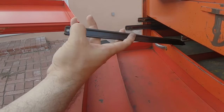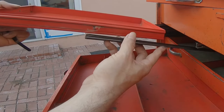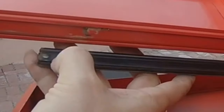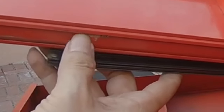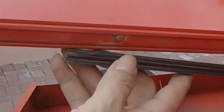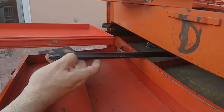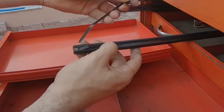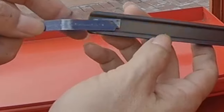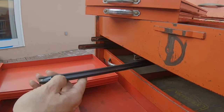This tab is on the inside of these slides. When it's inside the drawer they slide in the track, so this little tab is hooking this louver or dimple — just a little cup that sticks up enough to catch — so the drawer slides out and stops there. This tool holds the tab down so that when the drawer slides out it pushes it down and allows it to clear. That's all there is to it.